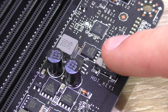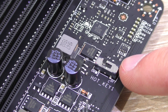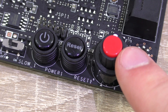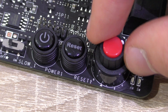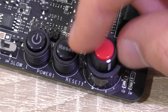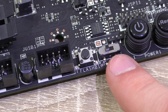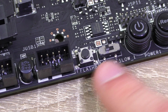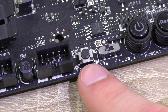Up here is the new gaming hotkey switch, which enables more functionality using your own keyboard — you could assign functions or macros, turn the PC on or off, load overclocking profiles and so on. On the bottom right are the onboard power and reset buttons as well as the new GameBoost dial, which provides automatic overclocking with up to 11 different dial levels, making it possible to achieve 5GHz on the CPU. There's also a slow mode booting switch that can be used to boot at a stable processor frequency during extreme overclocks to prevent crashes. The Flashback Plus button beside it can indeed be a lifesaver.